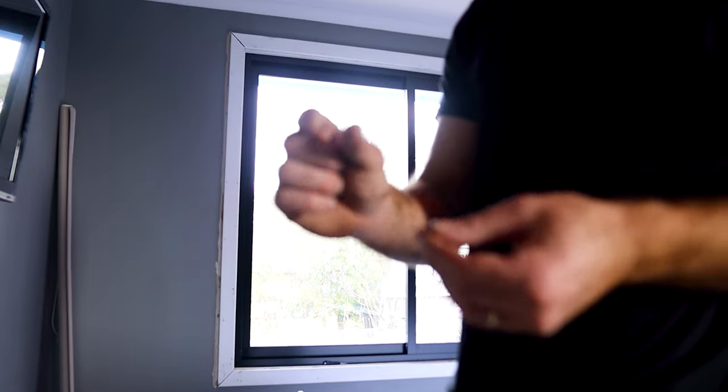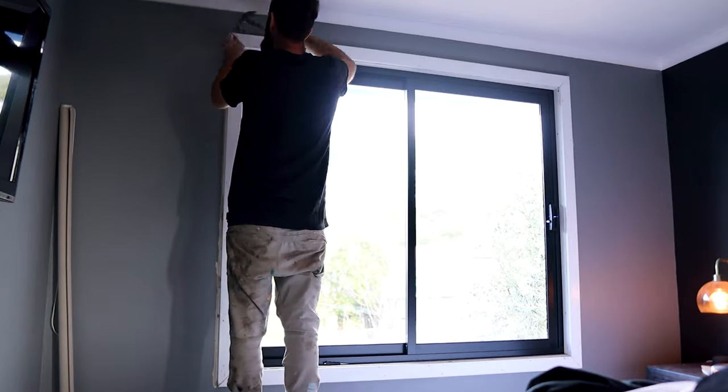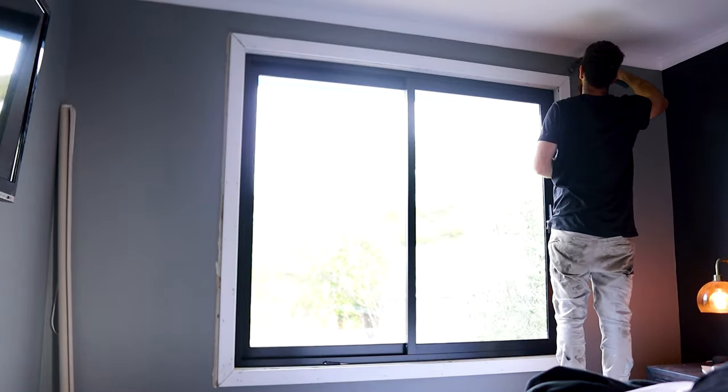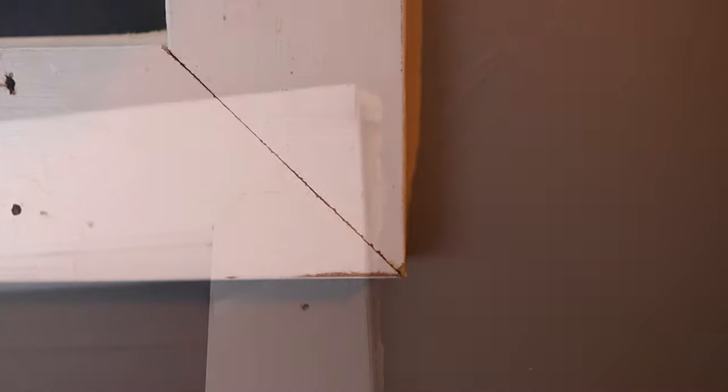The last thing we want to do is nail the corners. I've got these short little nails — they're called brads — and I'm just going to hand nail them. We'll put some brads in all the corners. That's going to hold them still and it's going to stop the paint from cracking down the road. Sometimes the corners won't always be flush with each other, so I'm using a chisel just to work them flush and then nail them in position, and that'll be a perfect job.